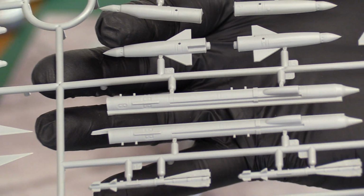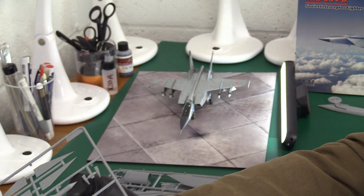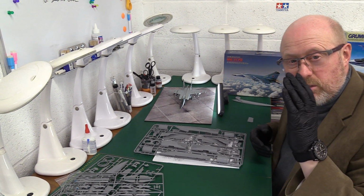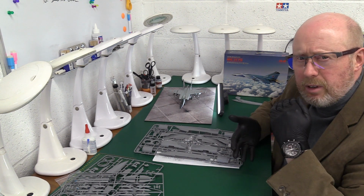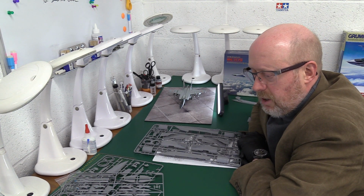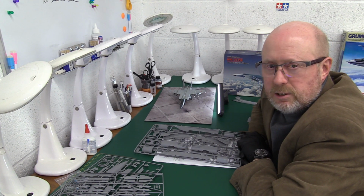So you haven't got this sort of weak, undersized, too shallow and not correctly toleranced male and female spigot, which neither of them had any depth, no contact area, and they weren't the right sizes. That is a much better solution. That gives you a chance to use conventional cement and get your contact area, and it'll stick properly.